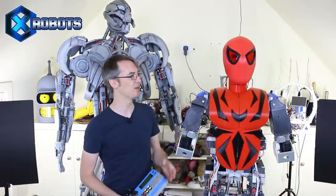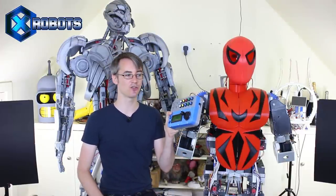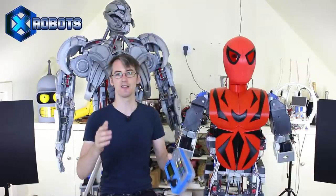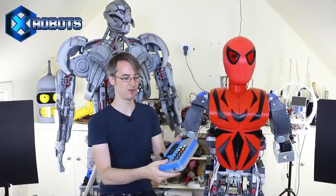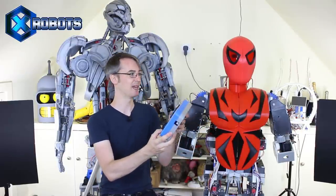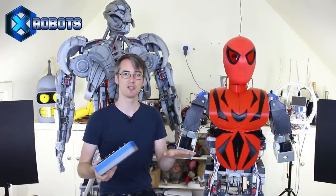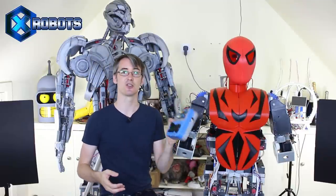That's the end of this episode, but next time we need to remember that this is actually a robot and I haven't done much on the walking development for a while. Next time we're going to integrate back with the control system - at the moment I can control the arms with my three-axis joystick. We need to build head control in for one mode, and then a puppeteering mode that controls the head and the arms together, with various buttons for blinking or a shift key that changes modes. We can have almost infinite modes - in fact 65,000 by scrolling up and down. We also need to revisit making the robot walk with these cosmetics on, and I haven't put any pressure switches or sensing on the bottom of the feet to sense when it's on the ground. Hopefully we can make something much more dynamic that will deal with more cosmetics as they're added.